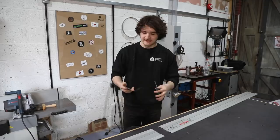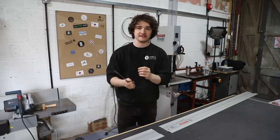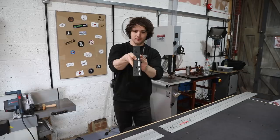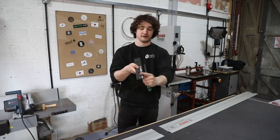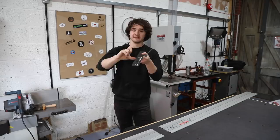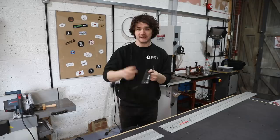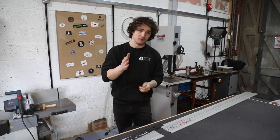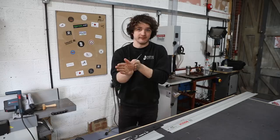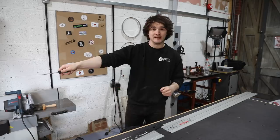This is a very simple yet incredibly useful change compared to other guide rail systems. Because it locks sideways into the rails, you can be 100% sure that the two guide rails are going to be in line with each other — you've got this flat edge along the back of the joining bar, and when the cam locks are pushed out it pushes the two bars against this edge. Whereas on other guide rail systems it's usually grub screws tightened from underneath that expand up into a T-track, and because they're moving up you don't get any guarantee that the joint is going to be perfectly straight. If there is a little bit of wobble in that joining bar, it's entirely possible to lock the guide rails with a small kink — even half a degree over 1.4 to 1.5 metres will make a big difference at the end of the rail.